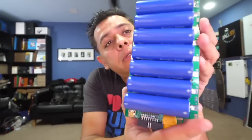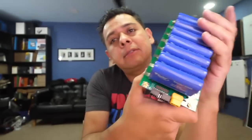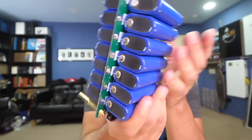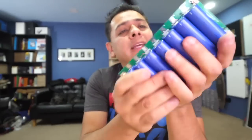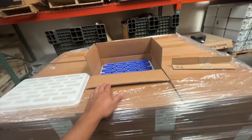All right, so we just built one PCB with a double-sided configuration — 14 of these cells. That's about 10 amp hours, 24 volts, and it would be capable of about 1C, so 10 amps continuous — about 200 watts. I know the board can handle more, and probably the cells can too, but the fuses can probably only handle around 6 amps before they burn.